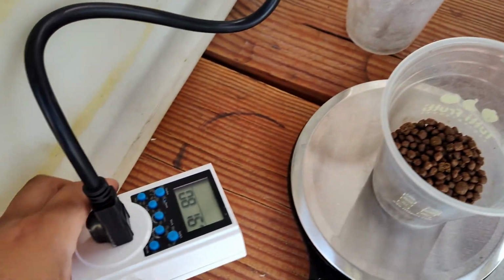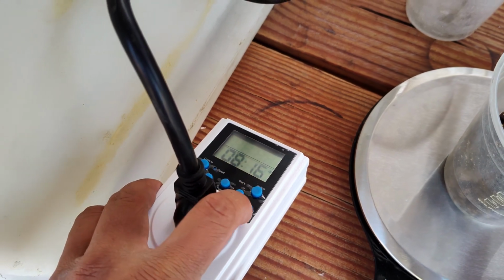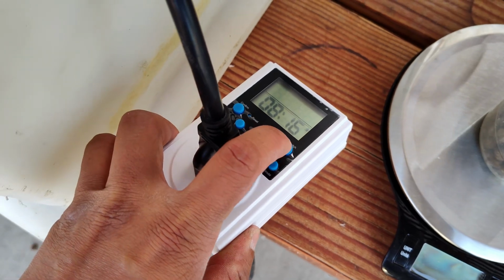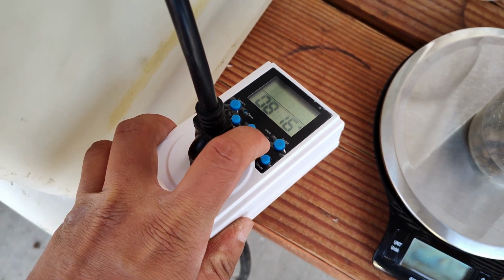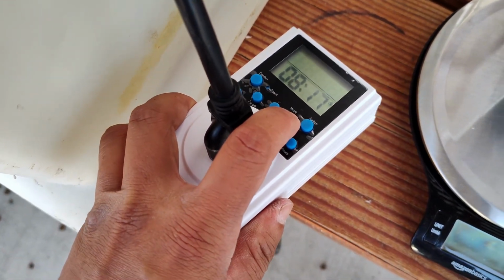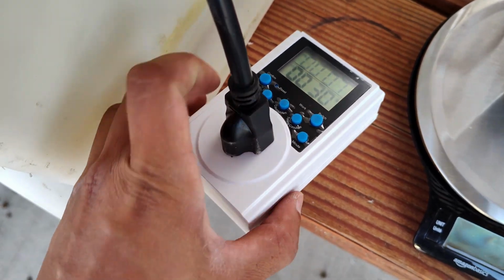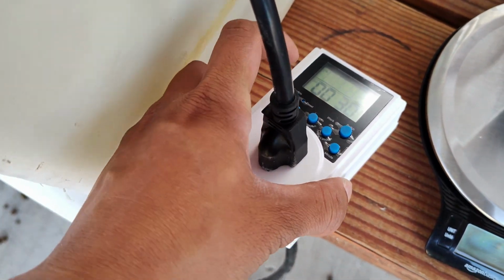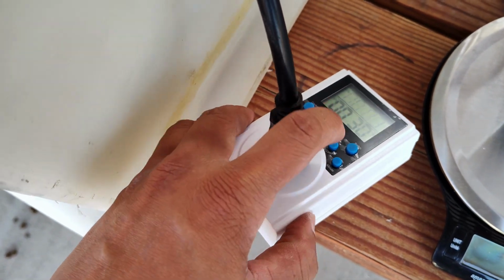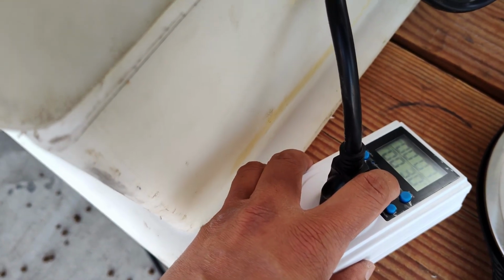Okay, so here is the other thing. All right, so now that we have the time cycle, that means we're probably feeding from the day until early evening. Now we want to switch to the time circulate. So this one will give us a more fine adjustment. Hold it. Okay, so now we're on the minute and second setting. As you can see, I already have it at 7 seconds of dispensing and then a 30-second delay. Obviously, when we're feeding, we don't want a 30-second delay.